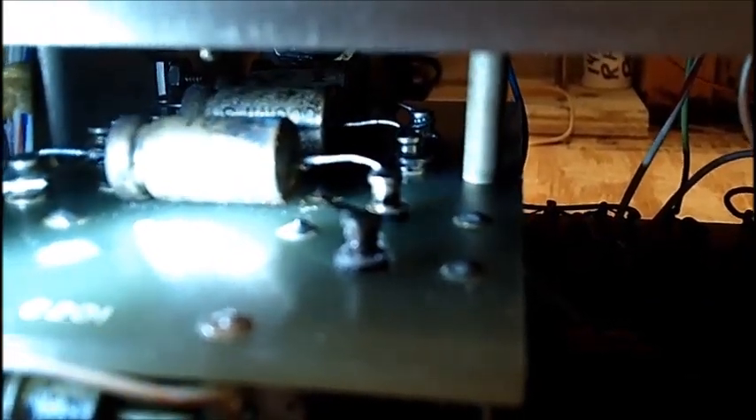The next one over is running very warm. I can't reach my finger in on the others, but I had the scope on for about five minutes with no display, and this electrolytic is running very, very warm. So it's either a shorted diode or a very leaky capacitor.